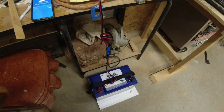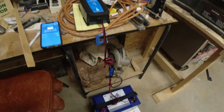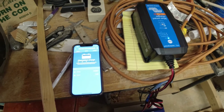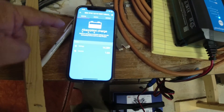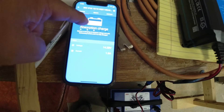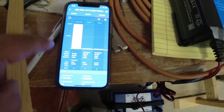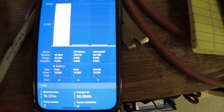It's in absorption charge now and it's almost full — the current will finally drop to almost nothing, and then we'll know it's completely full. When I took this out of the camper it was close to probably 90 to 95 percent, but it's dropped a lot just sitting here in storage, which is surprising. The app does show the state of charge gauge — when we started, the white line was way down below the half point. The gray area at the top indicates it's completely full.